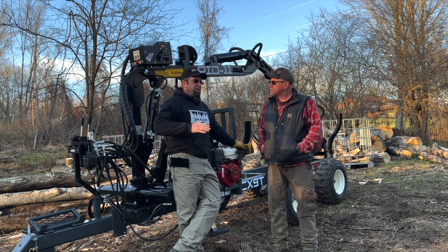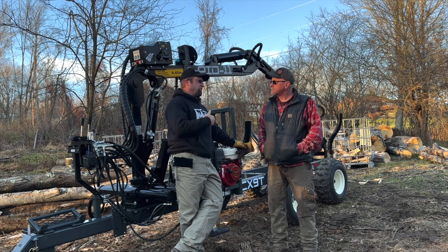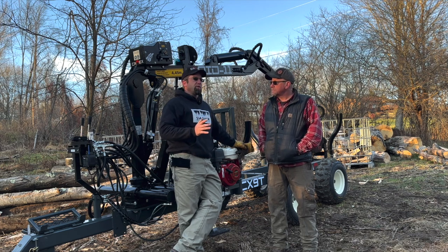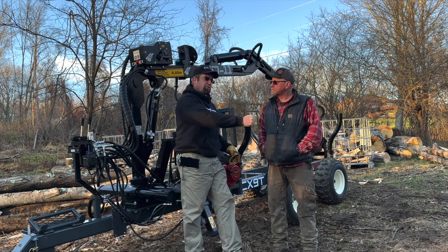It's literally 6 to about 9 gallons a minute, but it's the PSI, like we were talking about when you were loading stuff. Just like when you're with the wood splitter and you're trying to split and you're going through things, all the brute force stuff that we run is based around that 3,000 PSI mark. That PSI is your splitting tonnage. It's what sends that chrome part of the cylinder out.